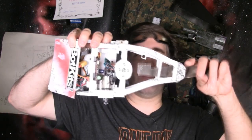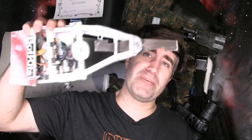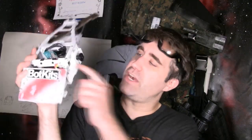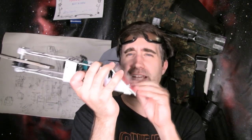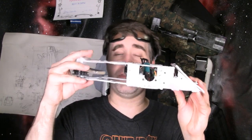I also have to address another problem I wasn't aware of: a number of competitions, including one I want to compete in this August, have size limits. Microflash is actually a very large beetleweight robot — from the weapon fully out to the very back is 15.5 inches, and some competitions have a 14-inch cube maximum. Central Illinois Robotic Combat has a 12-inch cube maximum. So if I want to compete, I've got to get this guy down to smaller dimensions. In the next episode, in addition to the 4S battery and final motor mounts, I'm going to chop about an inch and a half off the back and probably redesign the wedge to get down to at least 14x14.